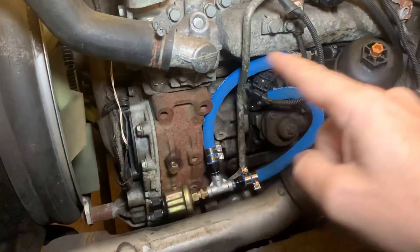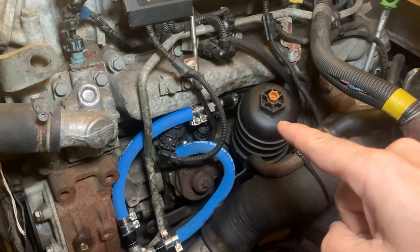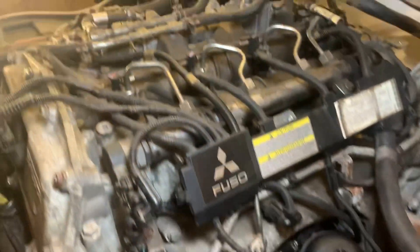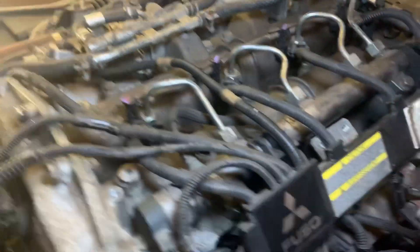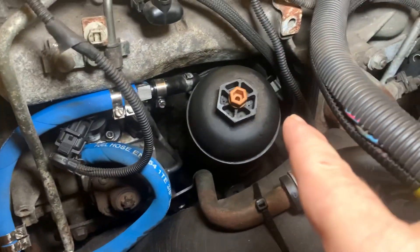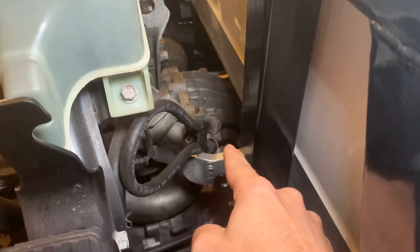I have managed to get a little bit farther from where we ended in the last video. Last time we were hooking up the lines for the disaster prevention kit. I've got the fuel pressure sensor, and I've now got the oil filter housing back in with the new lines in the back. I've also got the fuel rail put back in place, connected all the injector supply as well as all the injector returns, and those lines are connected down and behind the oil filter. I've also taken the old fuel lines that ran in behind the oil filter and made myself a loop line, so now the fuel line that runs up from the tank just loops and goes back to the return. That's going to allow me to flush the two nylon lines that I'm not replacing, that run from the tank up to the back of the engine and back to the tank.